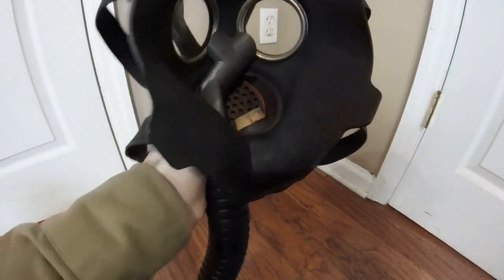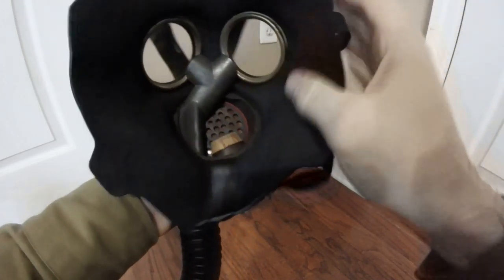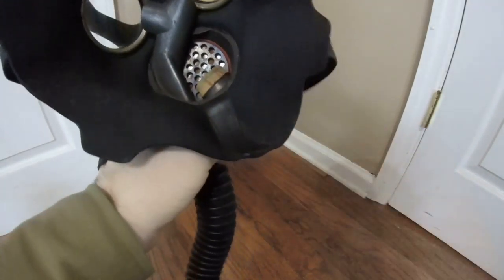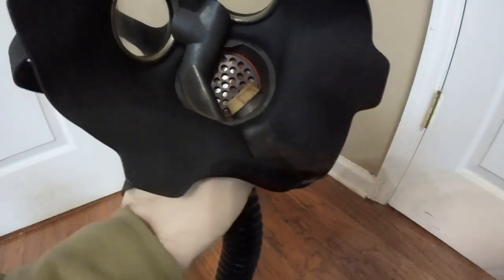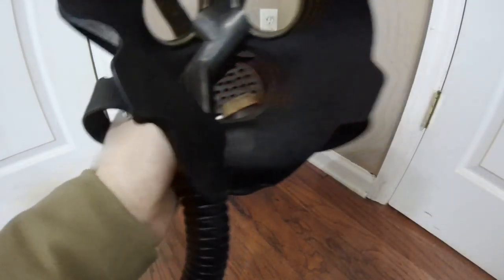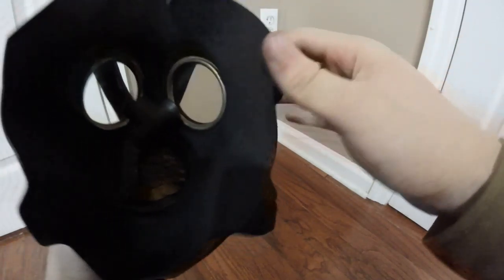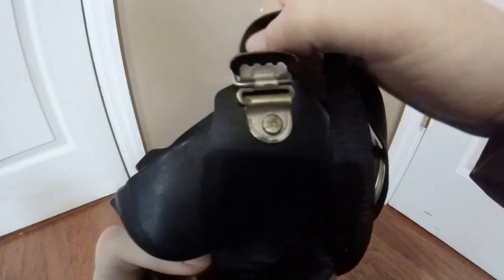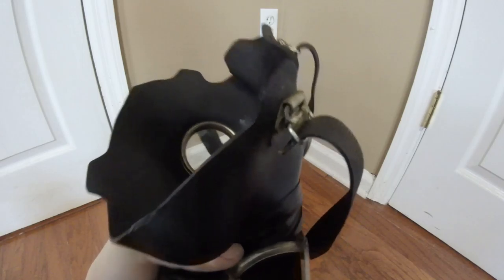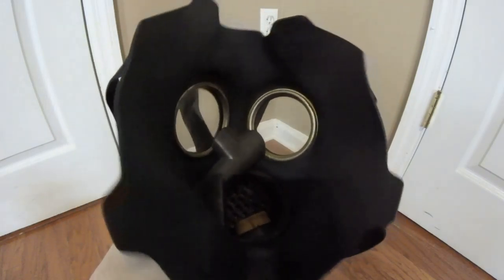You can also see how this mask was constructed. Like the KTM, it uses a chin seam, but done quite differently and to very high quality. Instead of sewing the mask along the chin, what the later black rubber Burel masks did was literally vulcanize it as one piece. There is a seam with a little bit of rubber tape, but it is all vulcanized together as one solid piece, rather than glued or sewn. You should also notice there are no rivets visible inside the mask despite the harness buckles being riveted on — because they're embedded into the rubber. This means if you wanted to replace or service the buckles, you couldn't access the rivets from the inside — probably not the smartest design choice.